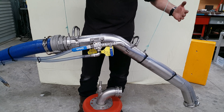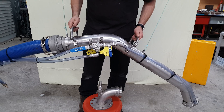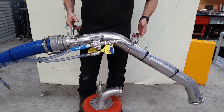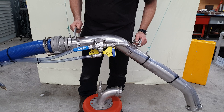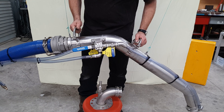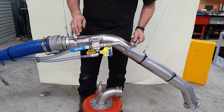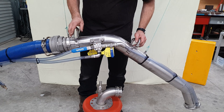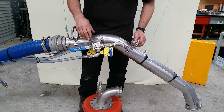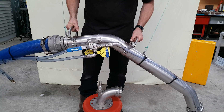What we've got here again is just indicative. You'll be putting a couple of floats up above to put this at neutral buoyancy. Again, it's at the diver's discretion as to what they want to do with that. Trying to keep it very very simple. So the two functions — jet ahead and reversal valve operation — are completely independent from topside. It's all controlled by the diver down here with two very easy to access, easy to operate stainless steel ball valves.